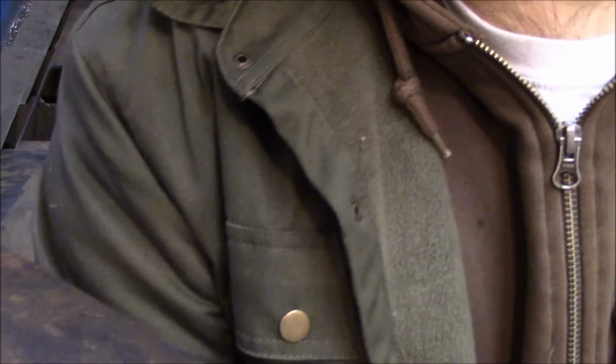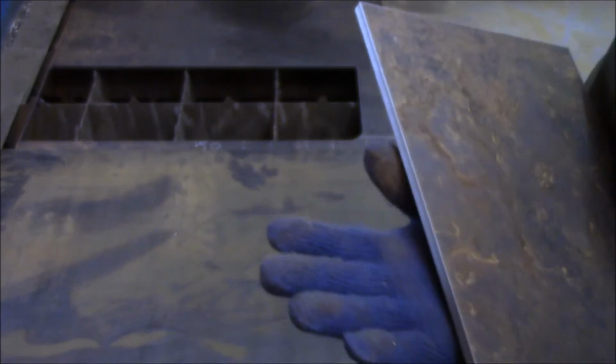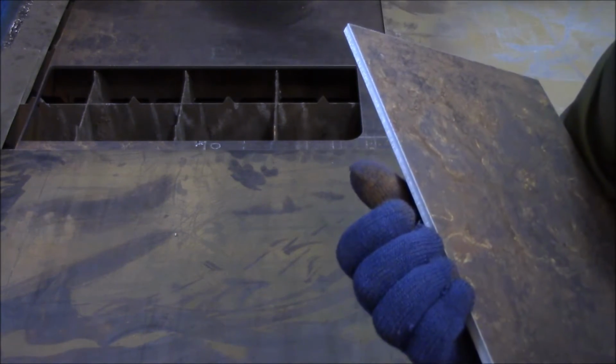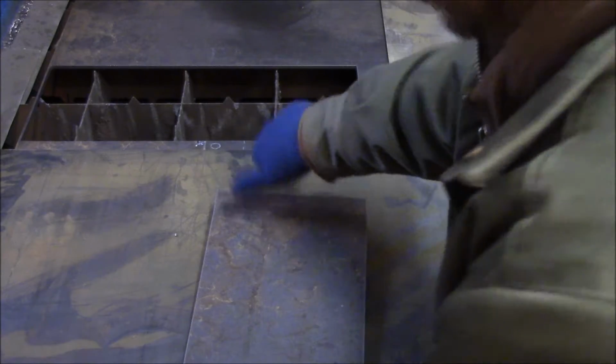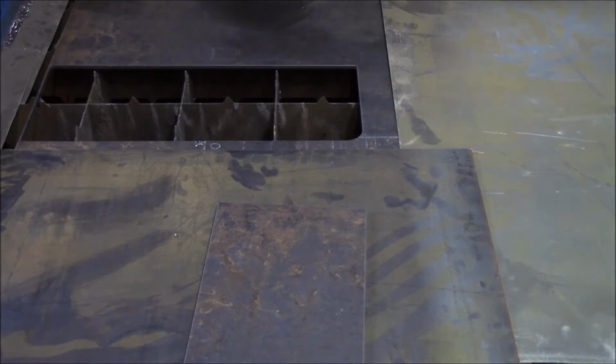That's the light dross that's left behind on that edge. It's not much. I guess the pierce point, the mark points, that's that little dimple that you see. It's more like it kind of heated the steel up, it didn't evacuate anything, didn't gouge it at all. I'd say it was probably enough that I would put a center punch on it and use it as a drill template, which isn't exactly what I was going for, but it's what I got.